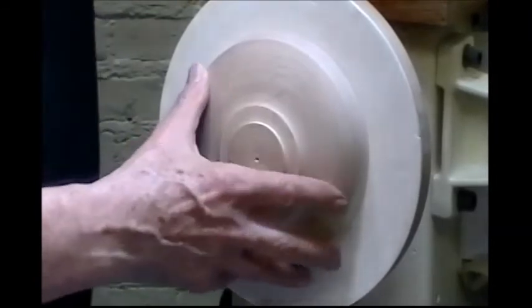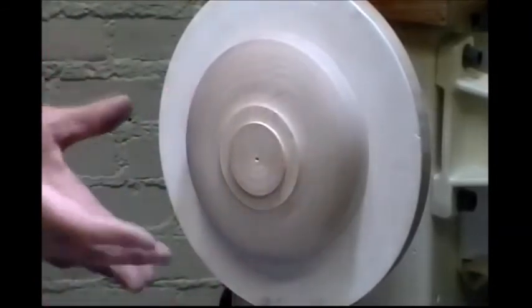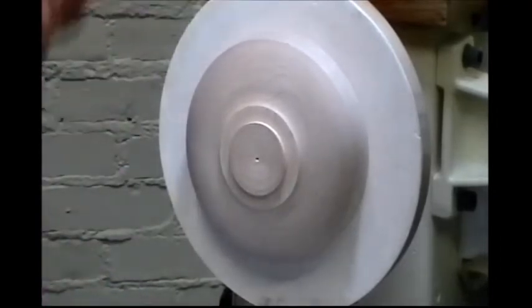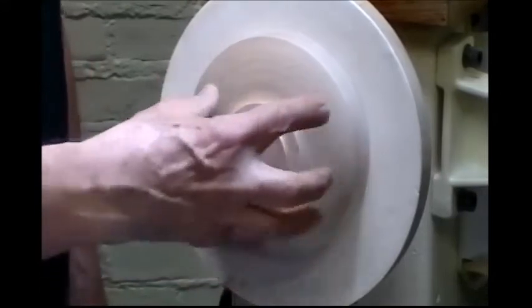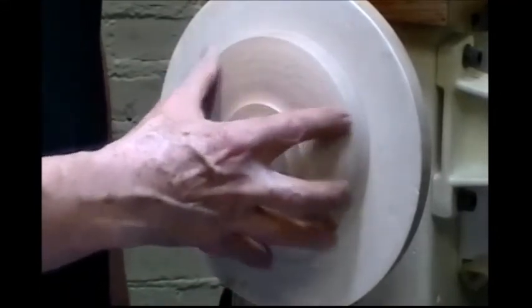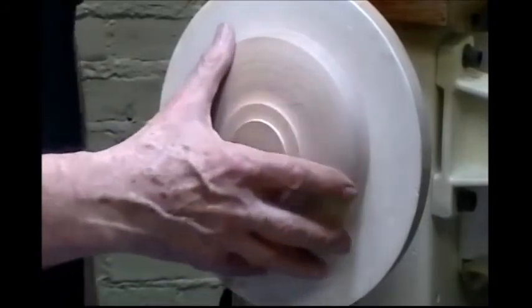What are we getting? Five. See, there's enough leakage in this bowl that I don't have enough cubic feet per minute on that pump. You bring tape? To get any more than 5 pounds of vacuum on here, or 5 inches of mercury on this.